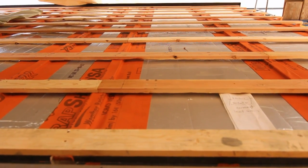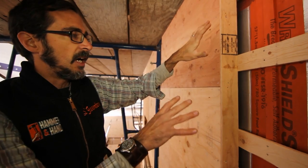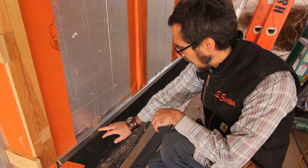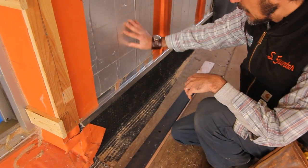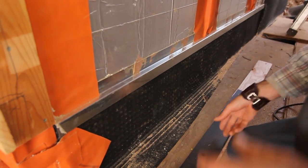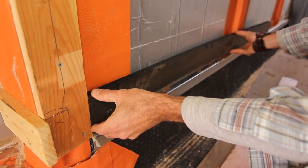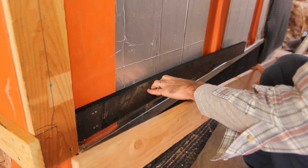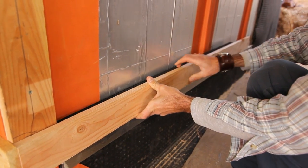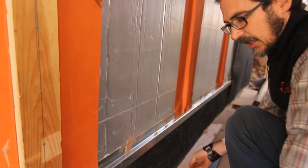You can pan the whole way up and kind of see what we've done. Big long sight lines on this project, so things are aligning at the bottom of the building and all the way up the top with wood pieces in between. This is what it looks like before we install the insect screen. This is the Z-Metal, our above grade drainage plane, this is our below grade drain mat — foundation drain mat. When we get to this point, we take our Coravent insect screen, cut and fit it between each siding strut, then it gets pinched with our last piece of furring strip that gets applied on and nailed — that pinches it into place and creates a drainage plane where insects, termites, cannot get up through.